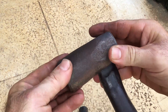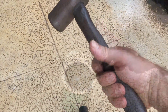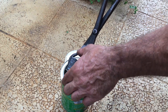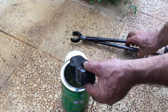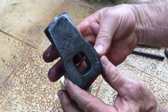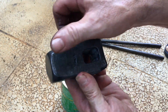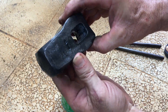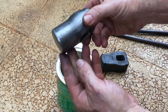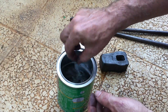I had the hammerhead in the vinegar for about a half an hour. It looks pretty good — it's not a slick black, but more tending towards a dark gray, lighter black. I'll drop this polished stubby hammer in the warm vinegar and see what happens.